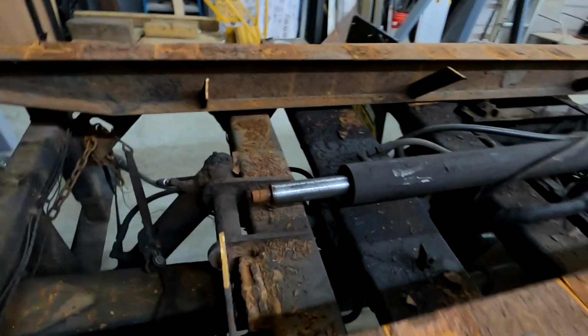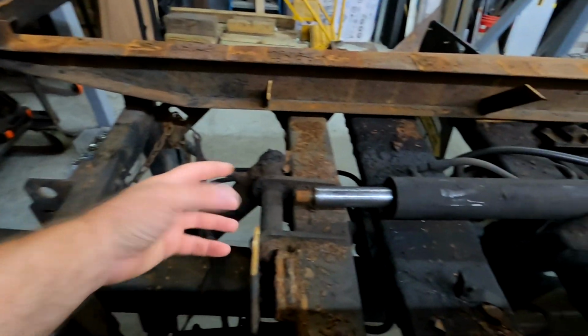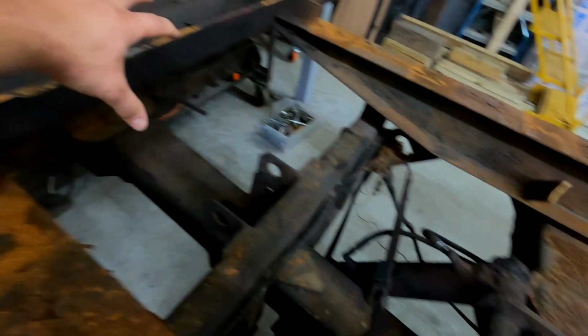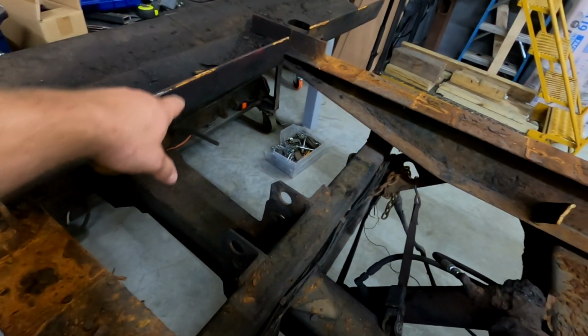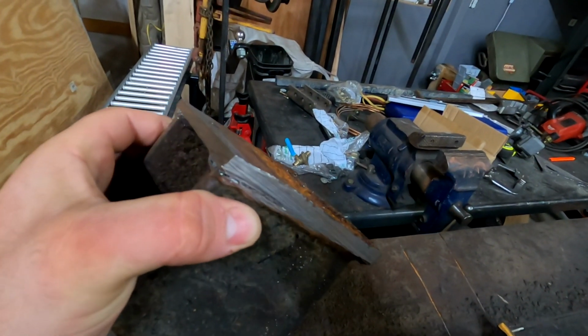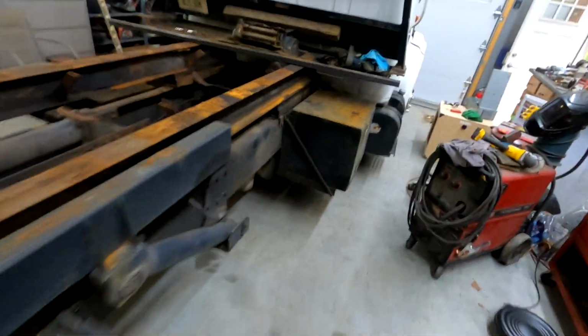One of the other things, since I haven't worked on tow truck beds quite like this, one of the other things I didn't know is the hydraulic ram that slides the bed back is actually welded up underneath the bed. So once I got the nut off of here, there's like a big contraption that's welded in here that goes all the way back and meets up right in there somewhere, and that's welded to the cross members. So I had to cut all that off and re-weld it. So that's actually the piece that goes on there. It actually mounts like this, or that bolts in, and then that was the piece of steel that was welded to the bottom of all the cross members. I just got to finish cutting that off. So I need to start cleaning this up so I can get these pieces welded on.